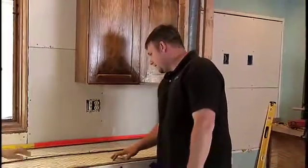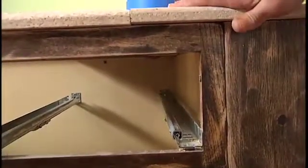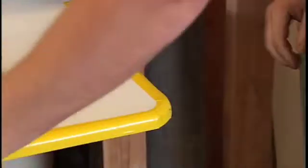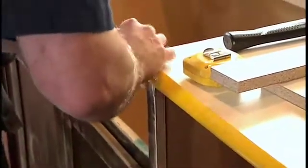Be more brittle. And that's why you'll notice we have tape along the edges here, and that's where you had routed over, so the coating was off of the melamine. Yeah, so we covered that back up. The router serves as a soft edge, so there's not a stress point for a place to crack, and then we covered it with just duct tape to give it the same concept as the melamine.